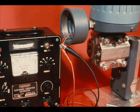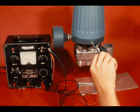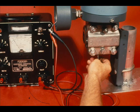If the output changes by more than 1.25 milliamps, repeat the procedure by again loosening the locknut, setting the zero at 10 milliamps, re-tightening the locknut, and testing the meter deflection.